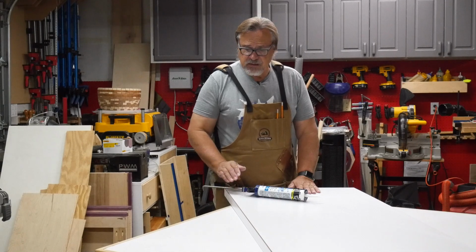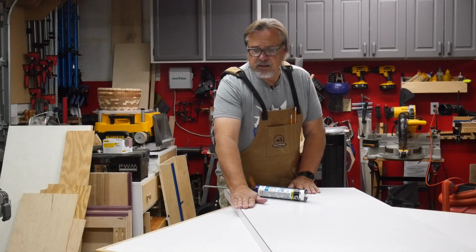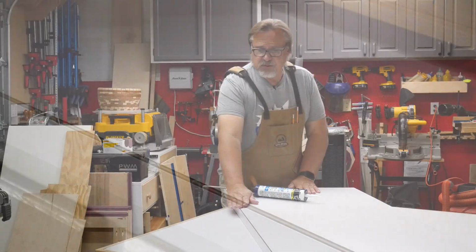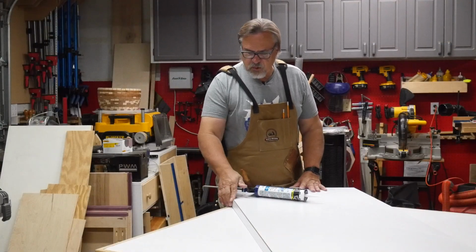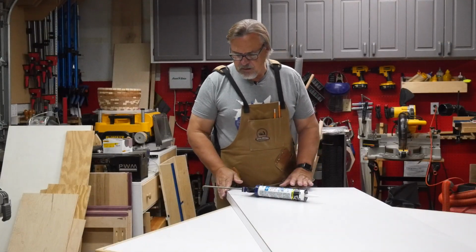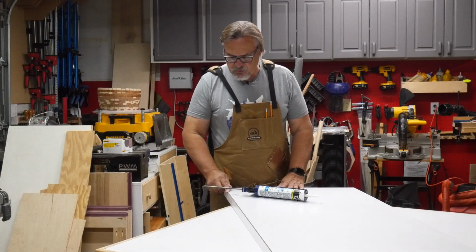The 45 had a nice low edge, gave it a little roundness to it, so it's not sharp right at the corners there, because it is really sharp once you finish routing it with the trim bit. But using a very shallow 45 cut does give it a nice little contrasting line here at the edge.